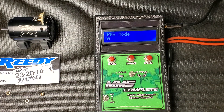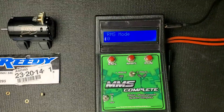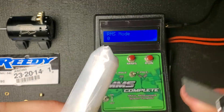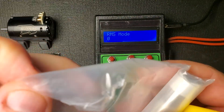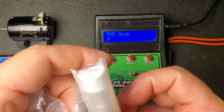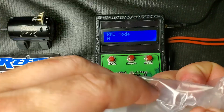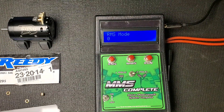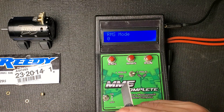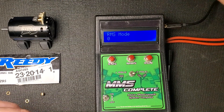In the previous video where we talked about tuning, a 1500 Gauss rotor typically would be something you'd think of as a high RPM rotor. The high torque rotors on today's brushless motors would run around 1700 Gauss for high torque. So these would be considered a high RPM rotor. With high RPM rotors, the timing that you can set and keep in a good power band is about 45 degrees, which is what these motors are set to.